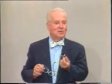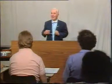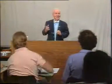What is the group size that I should consider to find out the number of cycles it would take to fracture the material? Suppose I tighten up between 5 and 10. How many of you took either 6 or 7 cycles to break the wire? And we have 1, 2, 3, 4, 3. And how about 7 cycles? 1, 2. And how about 8 cycles? 1, 2, 3. And so we find that within this particular sample, let's say between 5 and 10 originally, I have a spread of the data, right?